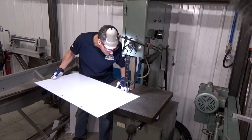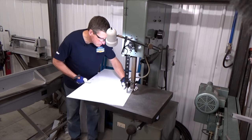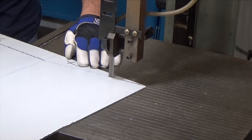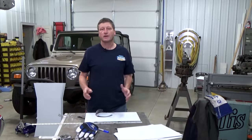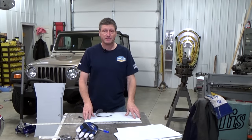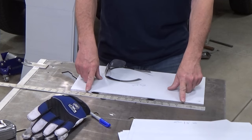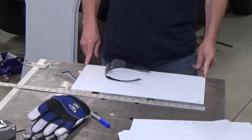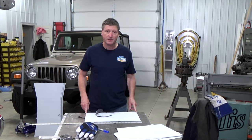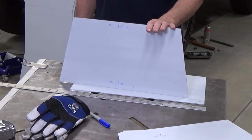I'm using a band saw to cut these out, but a plasma cutter, jigsaw, or even a reciprocating saw works well too. Now take all your 19-by-10-inch side pieces and mark 2 inches in from the top 19-inch side and draw a line all the way down to the outside edge of the bottom 19-inch side. Cut that off and make sure that all your sides look like this.